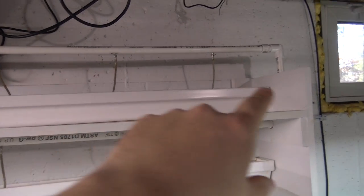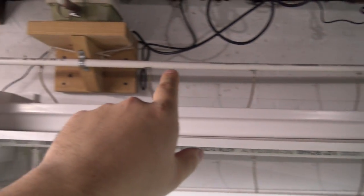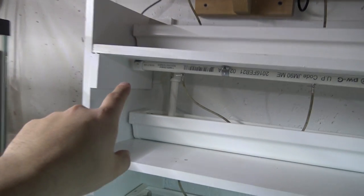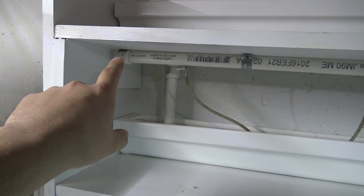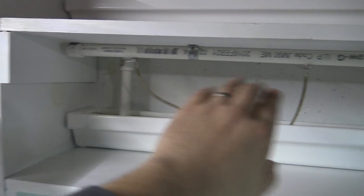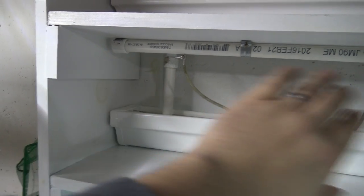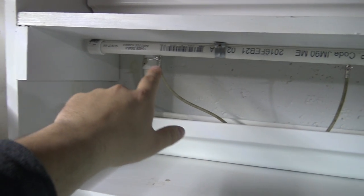and eventually it just gets clogged up. And the first mistake that I made was I ended this water line. So on every level here, the water line is capped off and it's not allowed to continue. So what happens is all that debris just sort of builds up in the ends because all these are pressurized. And when these things get opened, sometimes they just get clogged.